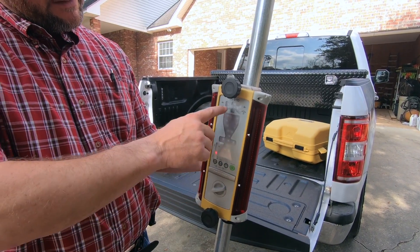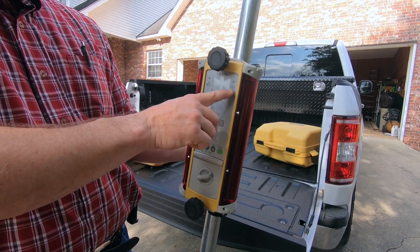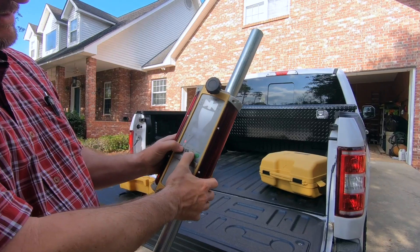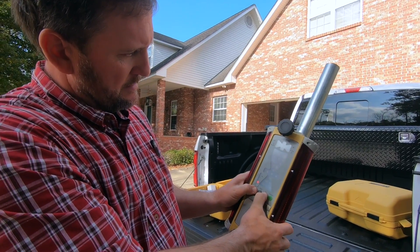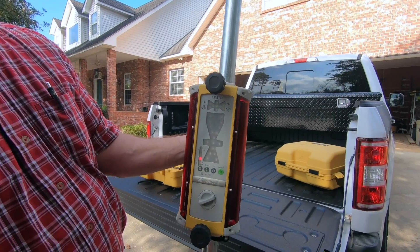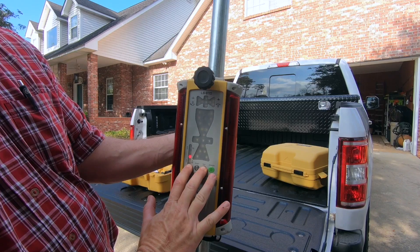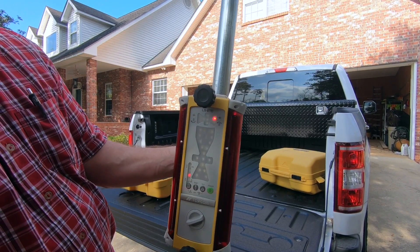Three across, one green up there — this is the sensitivity on the grade, and you've got sensitivity on your stick, or on the dozer blade up here. If you want to see what the dozer blade looks like, hold those two buttons in and do it again. Now you've got tilt on the dozer blade.